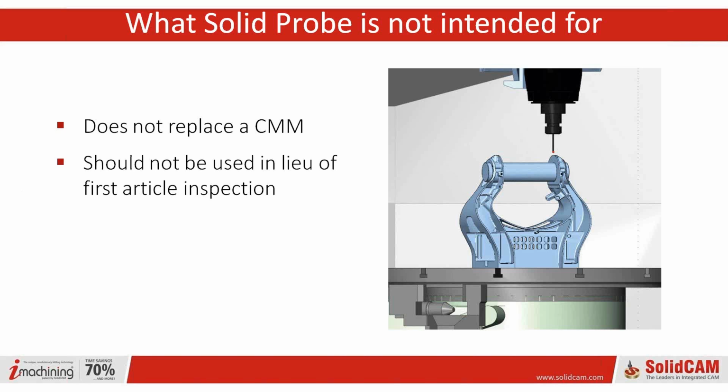First article inspection, oftentimes, they call it the fox guarding the henhouse. And first article inspection, just coming back from my metrology days, and just so that we're honest here, is generally done with an outside or independent measurement device. The reason being, it's the fox guarding the henhouse. If there's some issue with your machine, obviously you're not going to catch that if you're using your machine as a measurement device. So we're trying to be as upfront as possible.